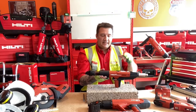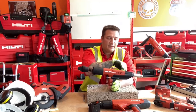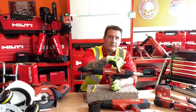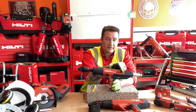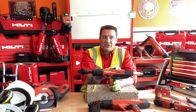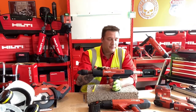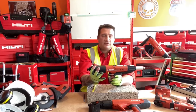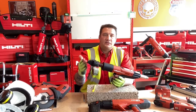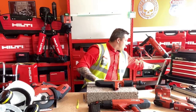This is the DX351 CT — the pole tool version. As with all direct fastening tools there are safety procedures: it takes a short fire cartridge — yellow, red, or black as standard depending on the power you need — and there's also a power setting on the tool from one to three for fine tuning to get the perfect fix every time. It runs off the piston principle: when the cartridge fires, the gas shoots the piston forward, which makes contact with the nail and fires it into the base material at low velocity. It's got an unintentional firing mechanism whereby it needs pressure from the front and the trigger pressed simultaneously, and it has unintentional drop-fire protection up to 10 meters.